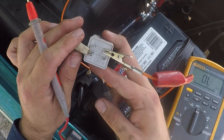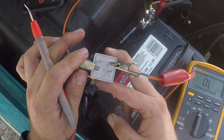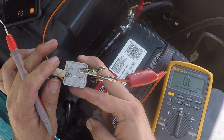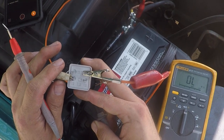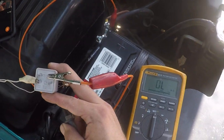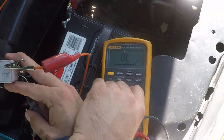That clicking sound is a sign it's probably good too, but you should never assume that's the case. I've seen solenoids for starters that were clicking, and when I tested with an ohm meter they weren't passing current — and sure enough, that's why my starter wasn't engaging. Thanks for watching — thumbs up, thumbs down, comment, subscribe.